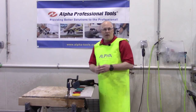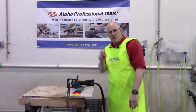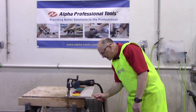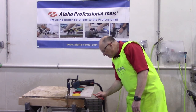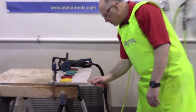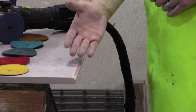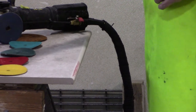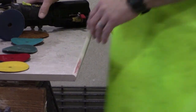I'm going to give you a helpful hint for all you rookies out there: if we take a China marker and put some on the edge of the material, this allows the operator to know when they can go on to the next grit. Once that red China marker is removed, you know you're able to go on to the next grit in the series.